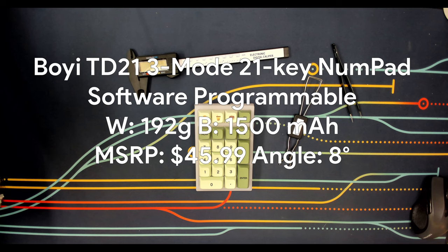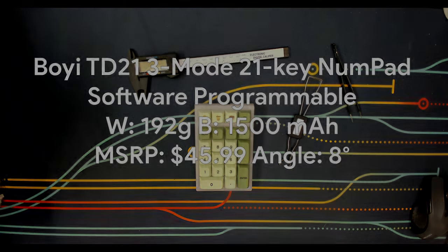The chin of this macro pad sits at 19 millimeters above the surface, while the back sits at 32 millimeters, providing for a typing angle of 8 degrees. It comes with a PC plate integrated into the top housing. It is well dampened and comes with Gateron yellow hot swap switches.